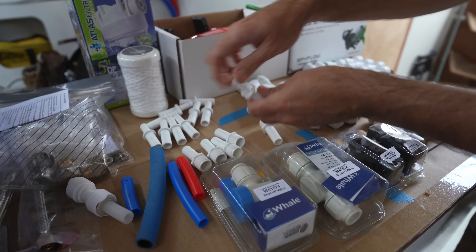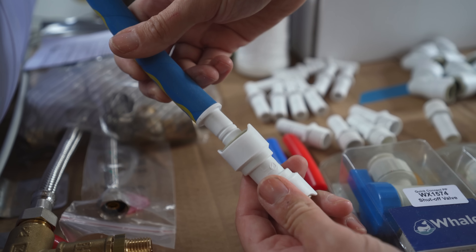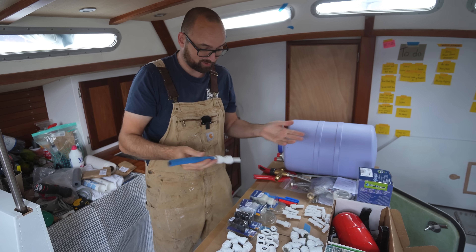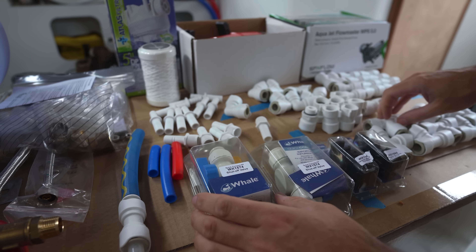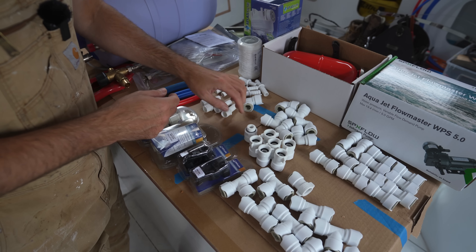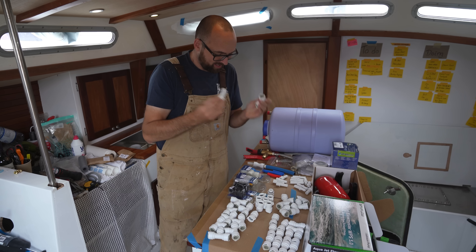Between the tank and the PEX tube we had some regular hose here — that's just to make a nice flexible connection. Of course to connect this to this we need some kind of fitting. There are two fittings here that might look kind of similar: this guy with a half inch thread and then this guy with a 13 millimeter hose barb — the hose barb is what we need to connect to this regular hose. The non-business end of these fittings is identical because that end is supposed to slide into one of these little guys — you just smoosh it in there and that's it. You'd need a hose clamp around the hose to make it nice and tight on the hose barb, but other than that it's pretty easy to combine these things. You could go into a straight connector, a 90 degree one, a tee, or one of these valve fittings. This is only a very small selection of options available — it's kind of like Legos in a sense.